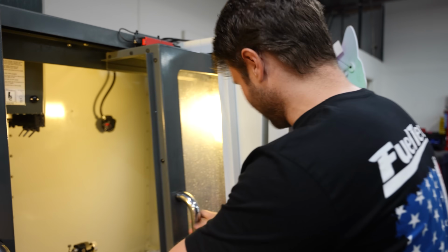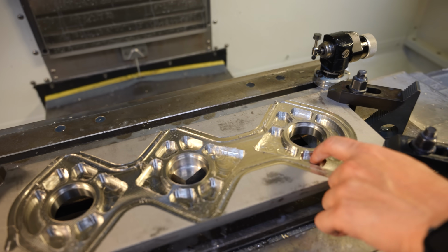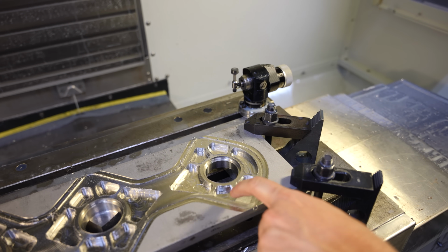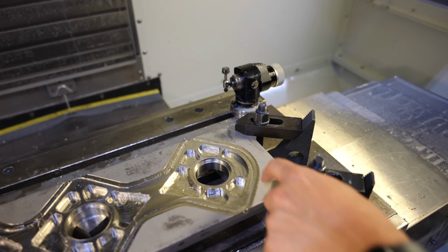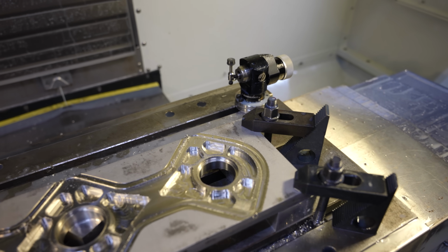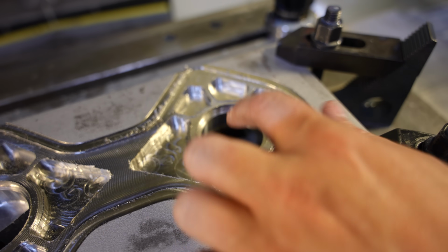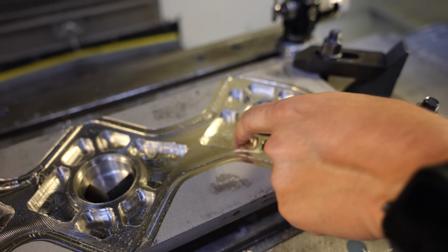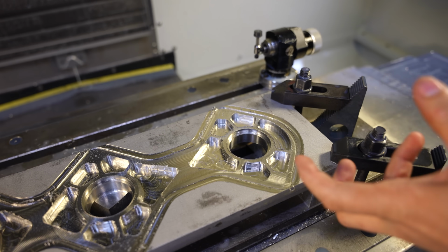So this is the beginning of the next step for us. Stainless is such a different animal to work with, but I'll go back over all of this, start facing it with the correct facing, and these edges, you know, that looks gummy. Somebody else said it, called it gummy, and that certainly is gummy. But this is a roughing pass, and it looks like it did a pretty damn good job at roughing it out. My goal is to try and support the exhaust that's coming out of here, but also not allow it to heat sink and bleed every bit into all the other metal here, and then go back into the engine as coolant heat.